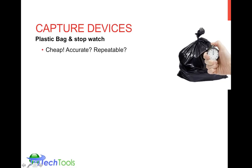You could add a static pressure tip to the bag, tape it into the bag, and look for this. I learned from Bruce Manclark out in Oregon. He works for Fluid Market Strategies, Clear Result Company. Basically, you can look for a spike in the pressure reading with your static pressure tip that's been taped into the bag. That would tell you that your bag is now fully inflated and you could stop your stopwatch.